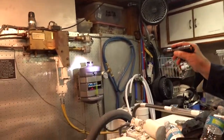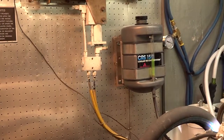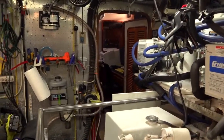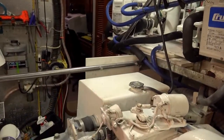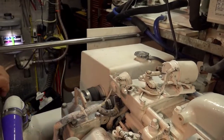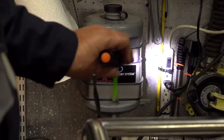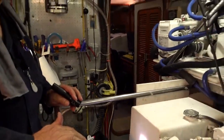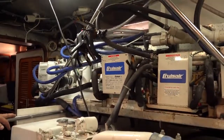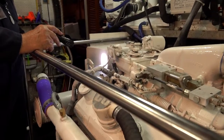There's a cooling system overflow — one for the port and one for the starboard. Be cautious about taking off the pressure cap when it's hot. When it's hot, the level indicator is showing it's full. This other one you can open because the hose goes up and down, and this shows your level right here — it should always show some fluid; we try to stay in the middle. When the engine gets hot the water expands, and without this expansion tank it would come out the hose into the bilge. This lets it expand into the tank and then come back as it cools down.